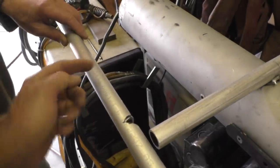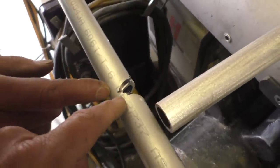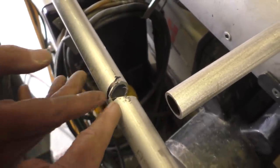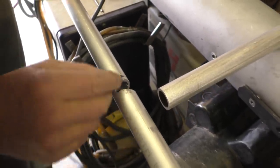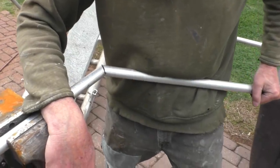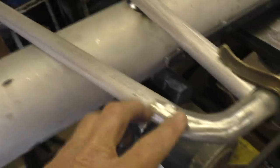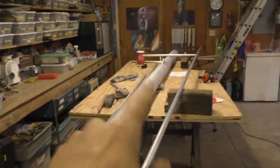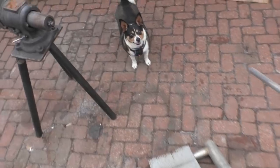We can put multiple ones in here and it gives us a nice round corner. This isn't really far enough across - it has to be a little bit deeper because you're not going to bend that much material. Bring this down a little bit, make it a little deeper and a little wider, then fold it in. Put another one in and it'll be just about right - a little grinder work on that and it's coming together. It's wider down there because that's where the mast is - there's more sail down there so more rack to hold it.